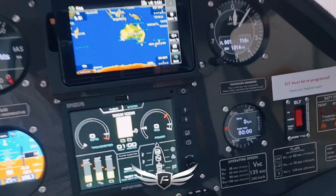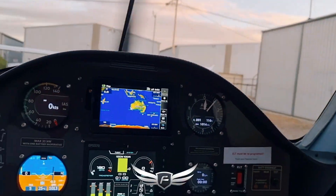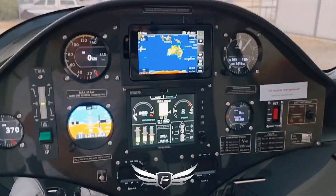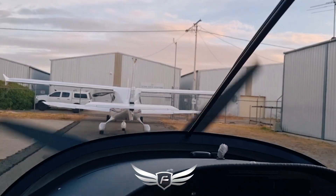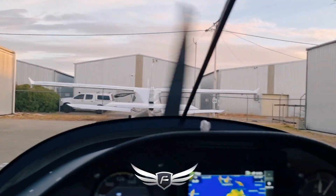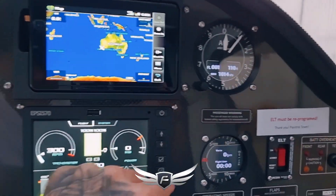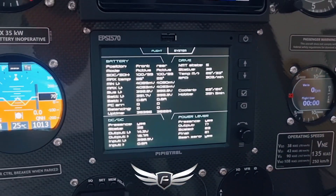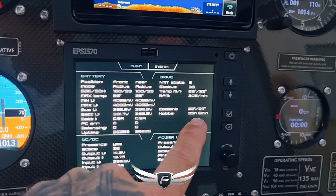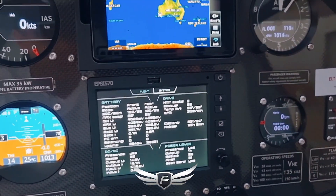So what I'm going to do here is just engage everything and get a mild spin on the prop. We're there at a very, very moderate level — just a gentle fanning going. How's that breeze? Just to make sure everything's free and clear and operating, we're going to do a couple of checks to make sure we've got a change in coolant temperature, which indicates that the coolant is in fact flowing. This is our data page on the system menu.